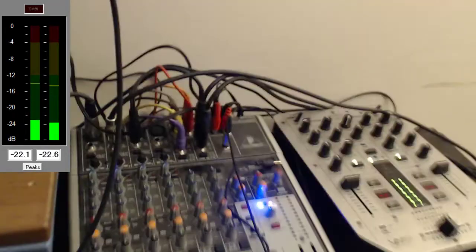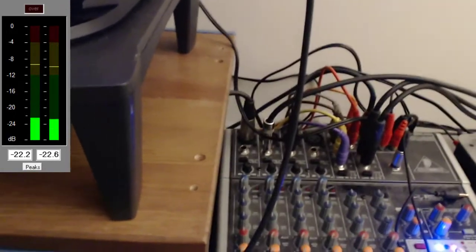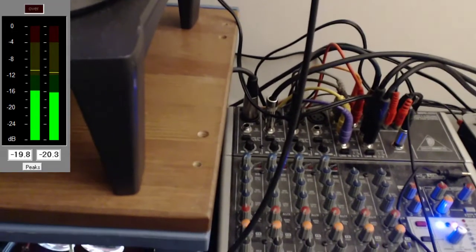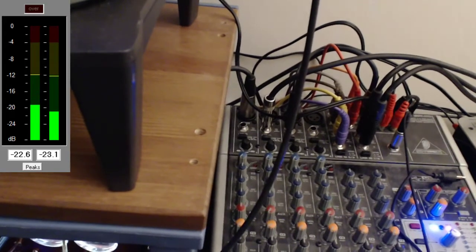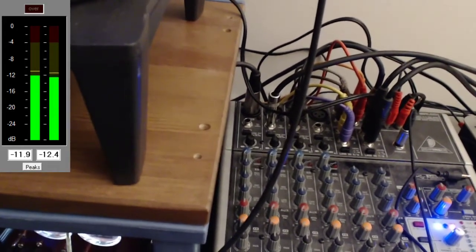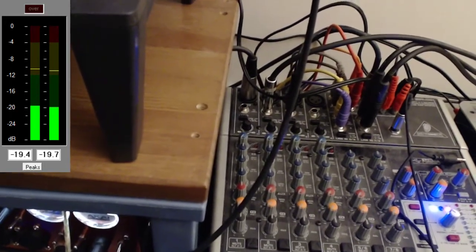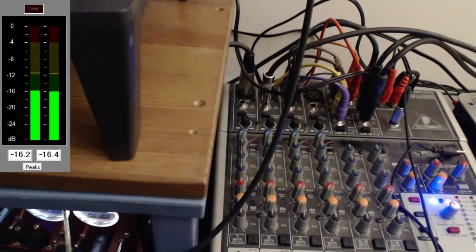So we have the microphone, which is plugged into the XLR plug. Let me see if my camera can reach. As you can see on the leftmost channel, you can see the XLR plug going into there. That's where it's going. And this microphone has phantom power. It supplies 48 volts into that XLR adapter or XLR plug, and so it's powering the microphone. Plus the raw signal is going into that plug, as well as there's a trim control.